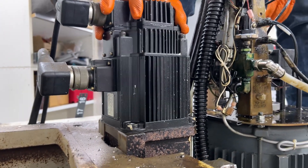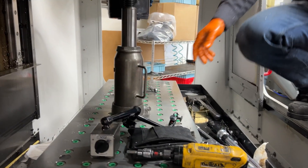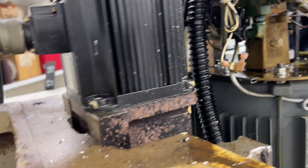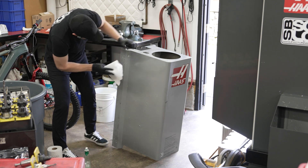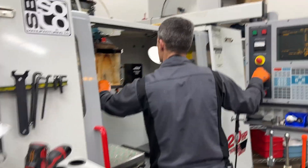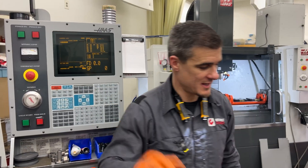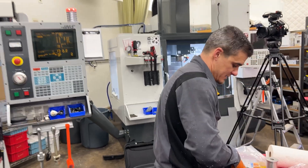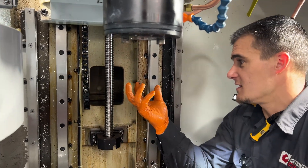So see how that's off right there? I'm going to rotate it around the ball screw until it lines up, because this one has a break on it — the other ones don't, you can just pop them in. I'm going to loosen up the nut housing and float it in. It doesn't have any load on it, but I want to make sure it's got the best alignment for longevity. Just run it up and down to get it centered in place, then torque it in.